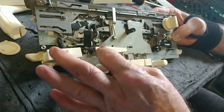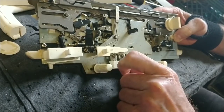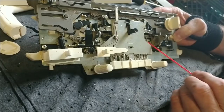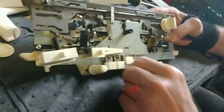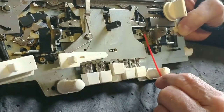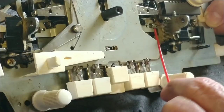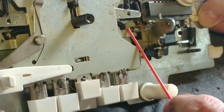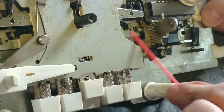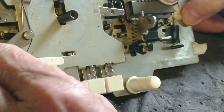Here's our cancellation lever that will fall off if we're not careful. What I want to show you is me moving this MC button. You'll notice with my little red straw, there's a slide fork here and a slide fork here on either side. You'll see when they move there's a spring, and I'm going to try to zoom on that spring gently. This spring — here is the flipper that it's attached to right there. It attaches one end to the slide; you can see the hole in the slide right there, and the spring end is in that hole.